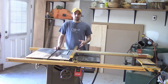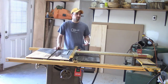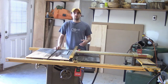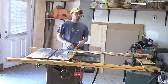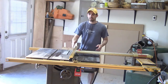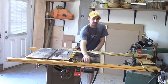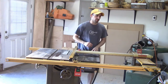This system eliminates that because it goes back to a rack and pinion system similar to what you would see on the old table saws from the 1920s — the Olivers, Tanowitz products. They used a rack and pinion, where you have a bar that slides in and out with the fence attached to it, instead of a fence like a Biesemeyer where it clamps down at the front and everything is locked off that front rail.